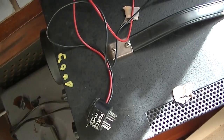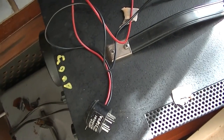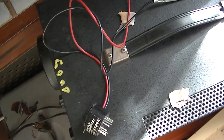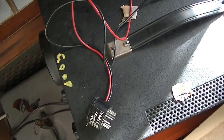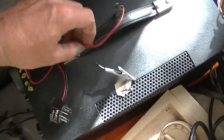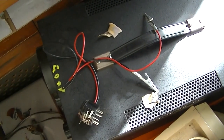The 6BQ5 is the audio one. The 6BQ6 also covers 6V6, 6L6, 6F6 — all those audio tubes. So these are kind of a nice thing to have if you work on a lot of these. Cathode current is very important.